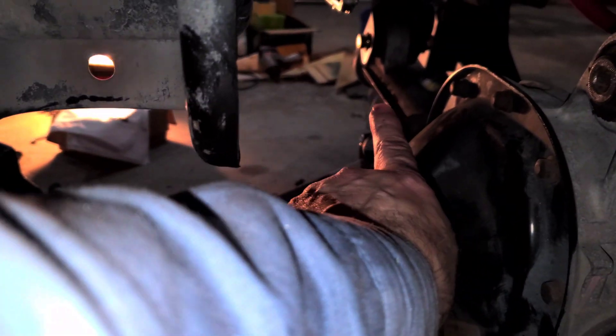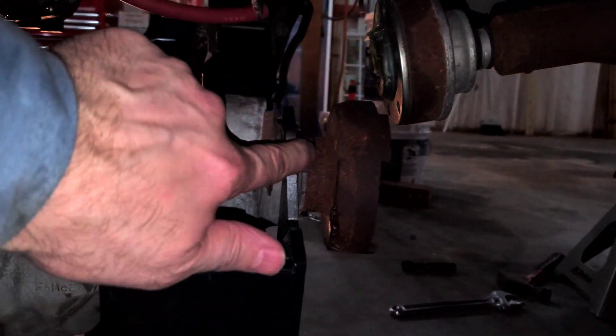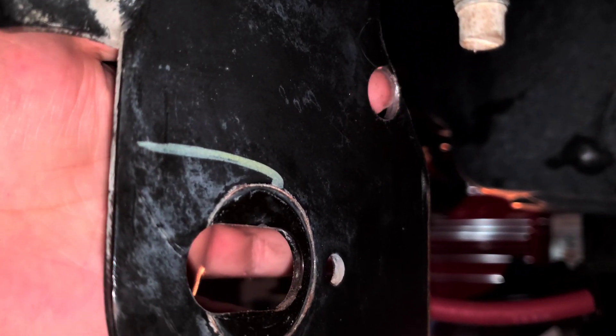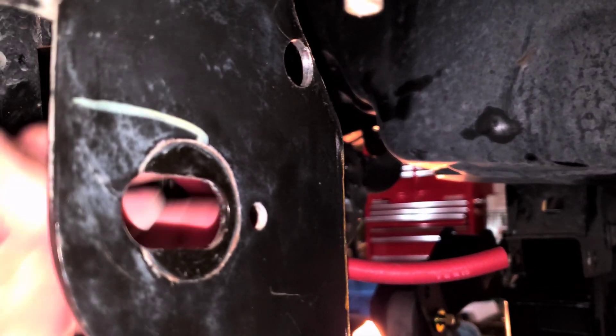I had it at the angle to get this bolt in. I didn't put it all the way through — I'm going to have to back it out a little because it goes through this hole that you drill. See, that hole you drill after you cut — it's in the instructions — that hole doesn't support anything, it's just for this bolt. This cross member is what holds it up, not that hole. I've seen people say you put the hole too far to the end, but it doesn't matter because this is what's holding it up, and these will bolt here.